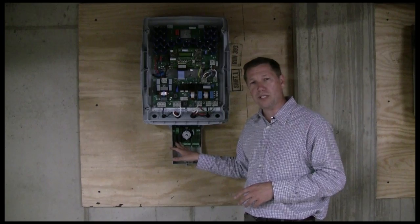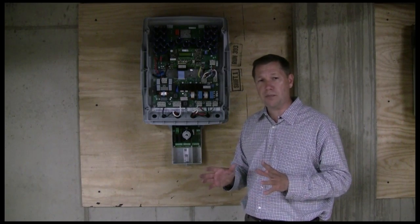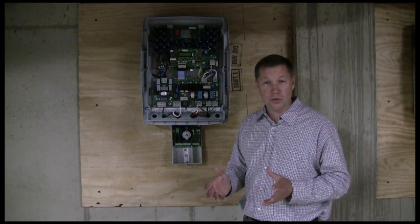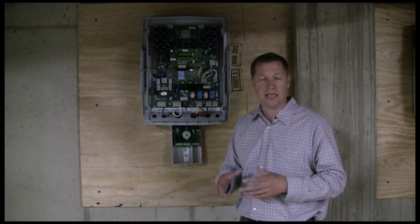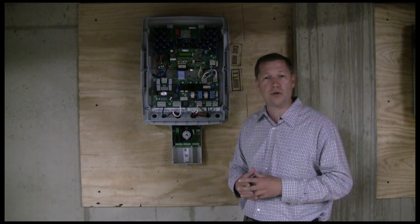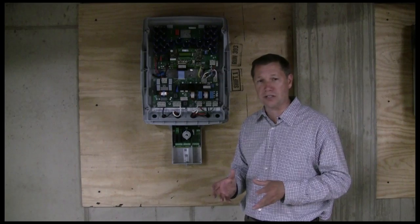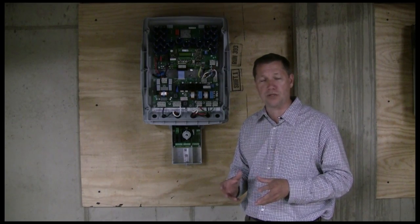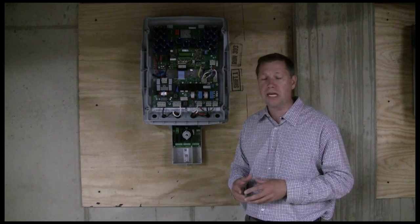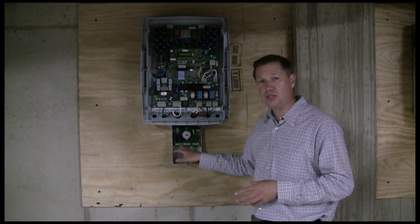You may wonder why there isn't a ground wire in this installation. These PVL-144 UniSolar panels are completely encased in plastic with no exposed metal parts, so there is no grounding required for the panels. It's a different case with glass or crystalline modules, which have a metal frame — in that situation, an equipment ground would be run back to the inverter.